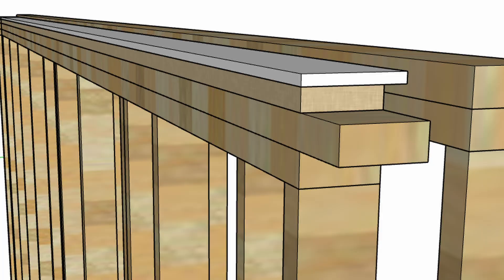When you're adhering this system to the studs, you could use wood screws — though technically that connects the walls, and sound could travel from the exterior wall through the half-inch drywall through a wood screw and down into your wall. This is probably very minimal, so you could place screws every 48 inches on center, or as minimally as possible just to keep it intact. Alternatively, you could use contact adhesive — a strong rubber-based glue — to keep everything together and attach it to the top of the wall without creating any rigid connections.